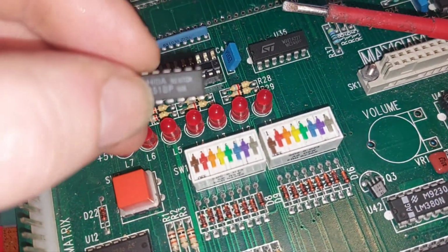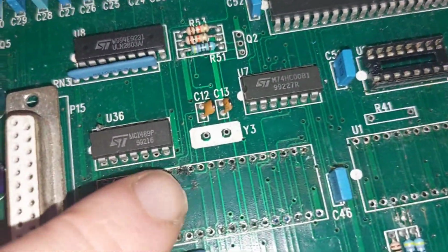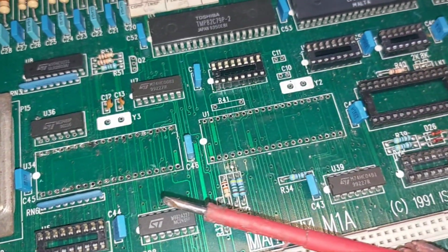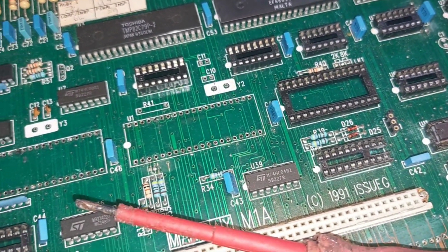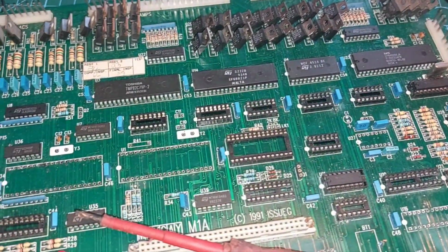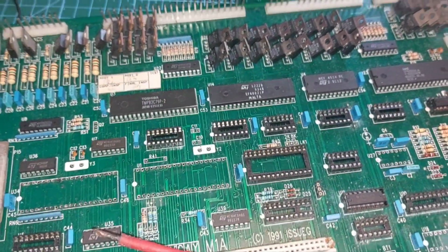It's people pulling the chip out too early before it's ready and ripping out the pad. There's an example of that there. See it there? I've got a couple of chips with through holes still attached. If I find one, I'll show you. Now, yeah, I'm going to reclaim this top bank here. And what I'm going to do, I'm just going to solder these. Fresh solder on them. And then I'll just use the manual sucker, as usual, to remove.